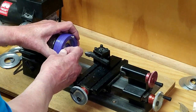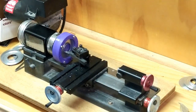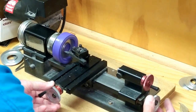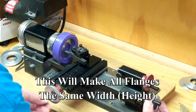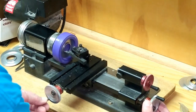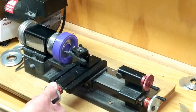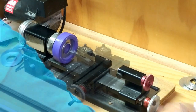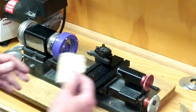That fin indexes on there. When you press the flange on this fin, this comes out here and it's a little bit uneven. So I'm just going to trim a few thousandths off the flange. When I cut these, I'm just advancing the same distance on the lead screw. I'm going to get the burr out of there.